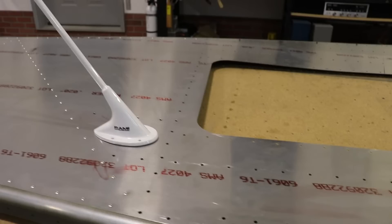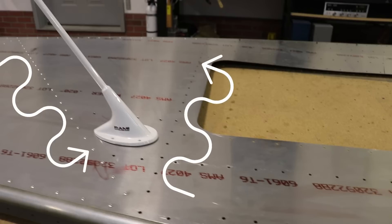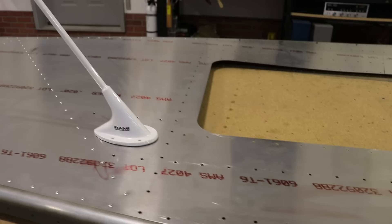I chose about the same location on the Super Duty as I did on my cruiser to mount the antenna. It's mounted on the top skin between these two lines of rivets or these two L angle stiffeners. I think that putting it in the corner there gives it the strongest location and it gives me a good mounting point for the doubler that I'm going to make.